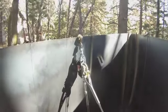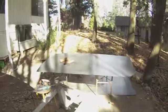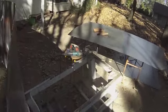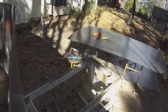Big breakthrough with this method today. I know it sounds simple but to me it was a discovery — I just added an extra block here so I could get more pressure this way, and I'm able to conform the hull almost to the curve of the rib. I should be able to just pull it in a little bit as I go towards the bottom as I weld it. I feel pretty confident about this method. I'm going to cut a whole bunch of these metal pieces and go down that whole length — it's going to take forever, but when all you got is hand tools and you want to do it cheap, this is what you've got to do.